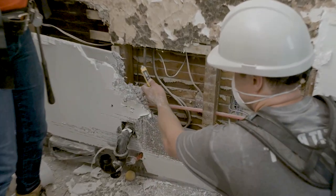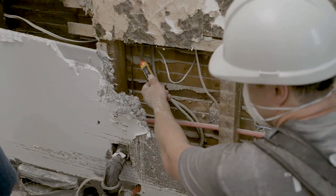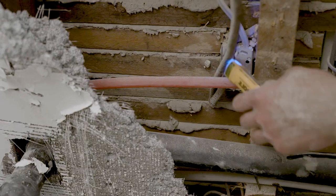When I walked into the bathroom upstairs and said pull this wall — people wonder why I say take it all down. I opened up the wall behind the toilet and there was a wire hanging down to the floor that was live. The floor was actually sloped toward where that electrical wire was. I told the homeowners: had you had a shower, not only would you have flooded the kitchen right away, but if the water pooled up and touched that electrical line while you were standing in it — could be very, very bad for your health. Could be fatal, because now you're the ground.